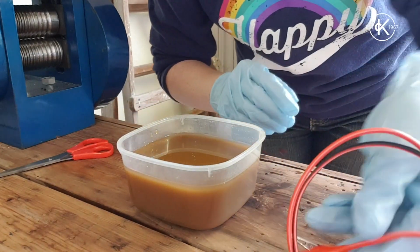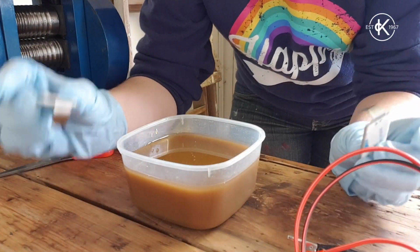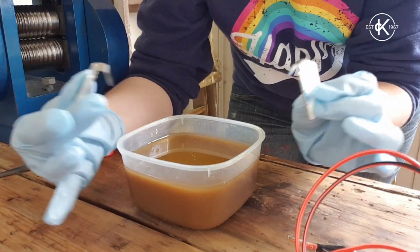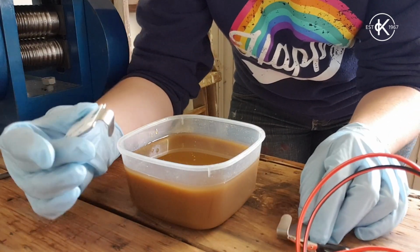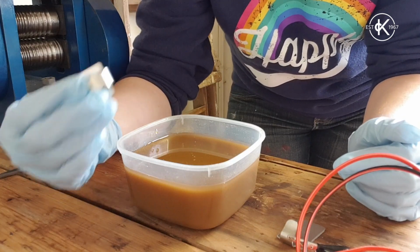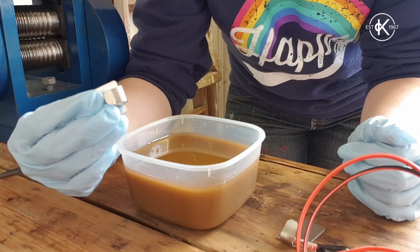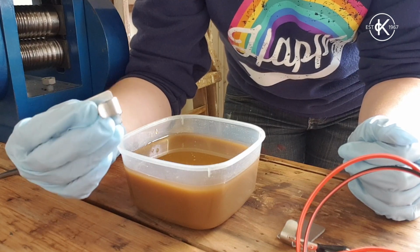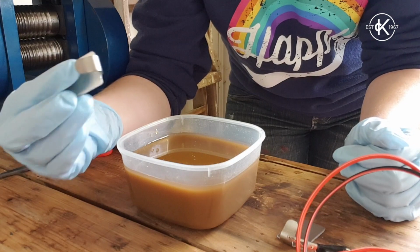So coming back to the power supply, when we were talking about the anodes and the cathodes, so the metal that we're going to use to help that energy flow through the electrolyte solution. Quite often when you read up on it, it says that it has to be the same metal as the metal that you're etching, and that's partly to get it to work, and it's partly so that the metals that you're using don't cause other reactions which are going to interfere or potentially be unsafe.